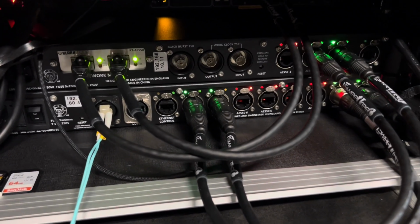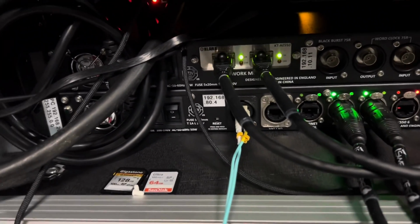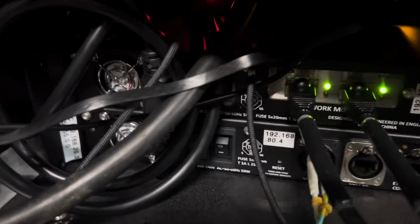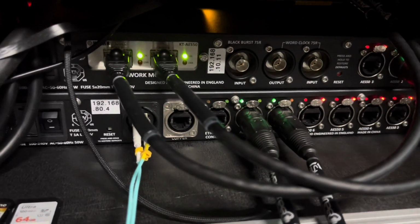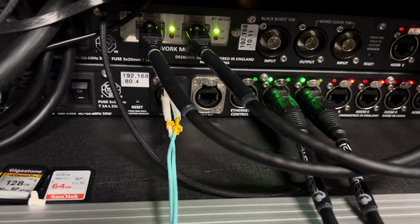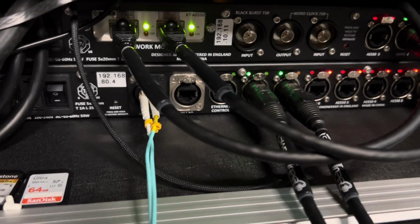All right, so this is going to be the back of the 9680 and the 9650. We try to make it look as neat and tidy as possible using, which of course all this is external stuff going out to things, but using right angle IECs and extremely short-length Ethernet cables. So what we're doing is we've got our 9680 on the bottom, and we're coming in with the multi-mode fiber. It cannot be single mode, and it is an LC connector duplex, or you can come in using Ethernet.